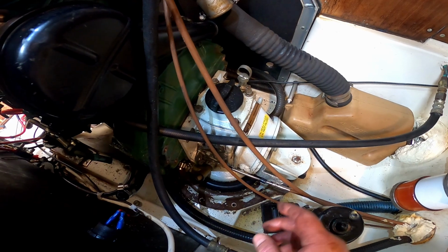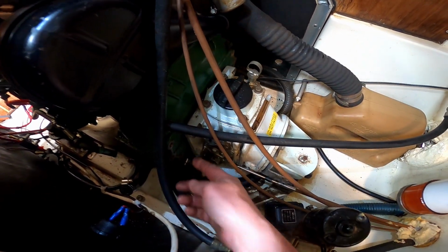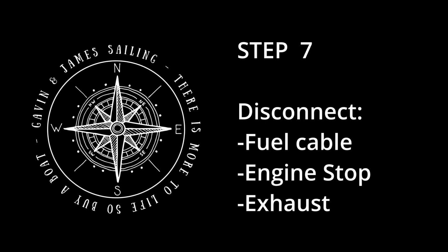Okay. We're now just trying to separate the Saildrive from the engine. So yeah, we've taken the bolts out of there. We've taken the engine mount bolts off. Okay, I just thought I'd jump in here to explain. We did try removing the Saildrive without moving the engine, but it wasn't possible, so we did have to move the engine forward. First of all, we had to disconnect the exhaust and any cables that were restricting it, and then we pulled the engine forward by hand. It was actually quite an easy job, and we didn't even have to use any wooden levers.